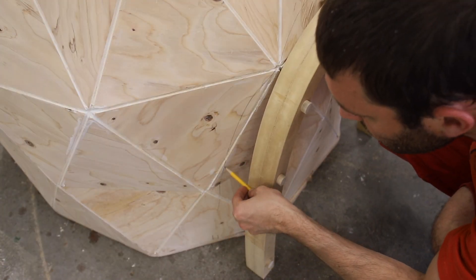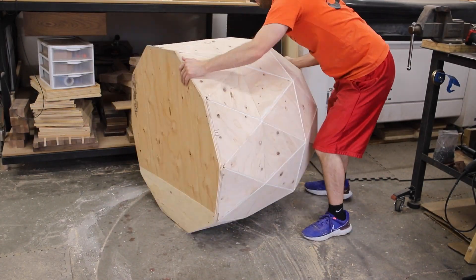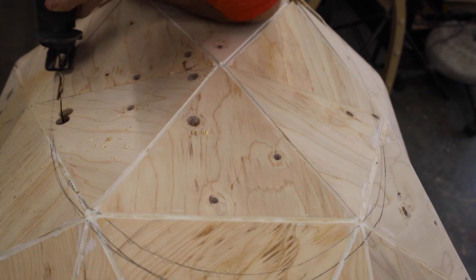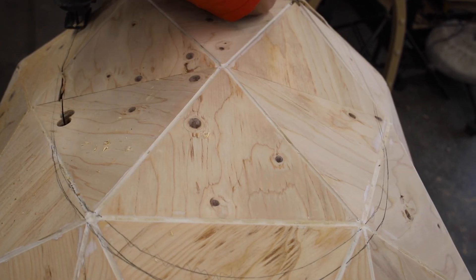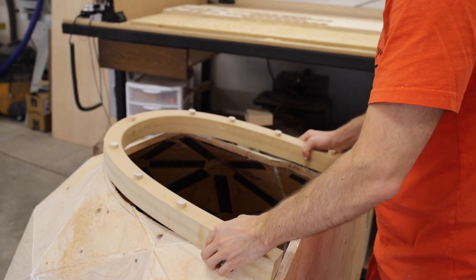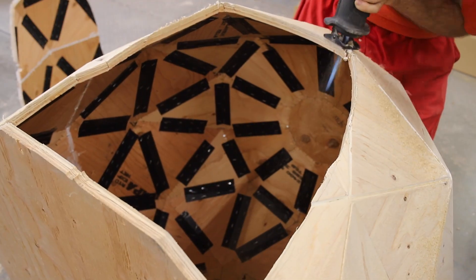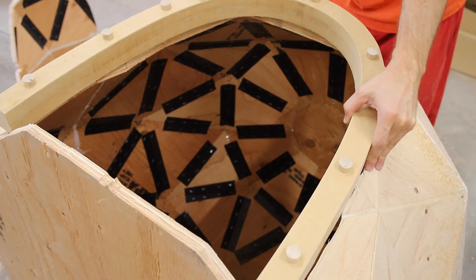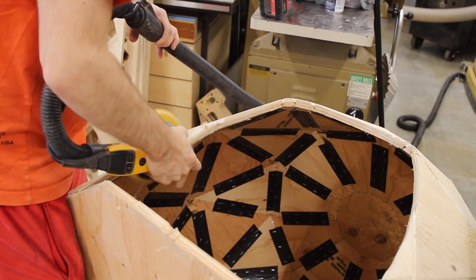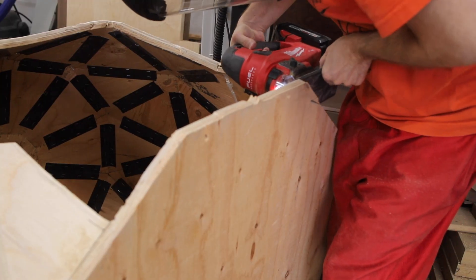I used the form we made for the glue laminate leaves, which was then carved as the door frame. A smart trick for projecting a line on this complex triangle dome is by tracing the door perimeter and holding the pencil flush to the frame. Then comes the point of no return — I have to carefully cut along the line. I played it safe and gave myself some extra space in case I sawed too much off. But not trusting my original line meant I needed to sand back until the door fit in snug. Two pieces on the front left side broke off from the staples, so after another delay of gluing things back together, I shaped everything until they all finally lined up.